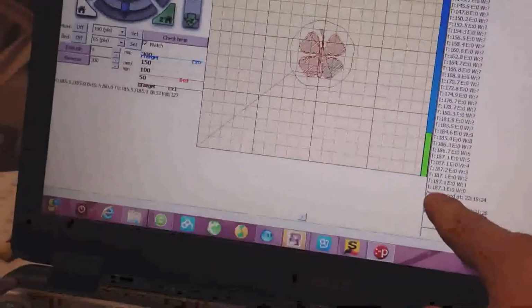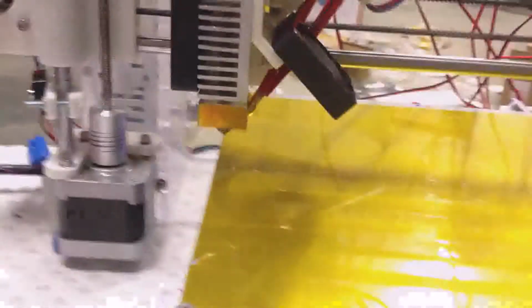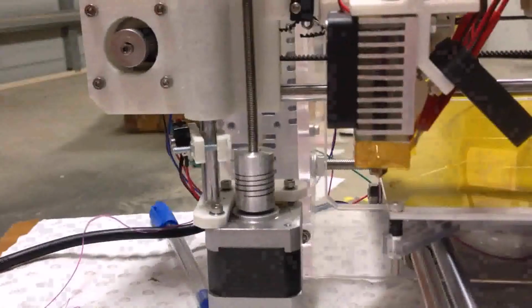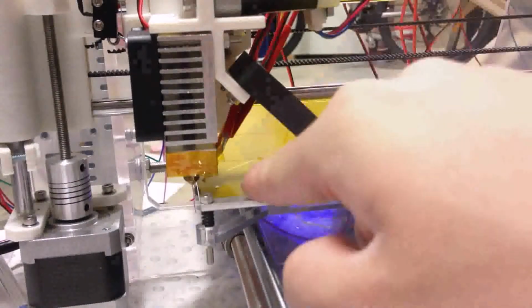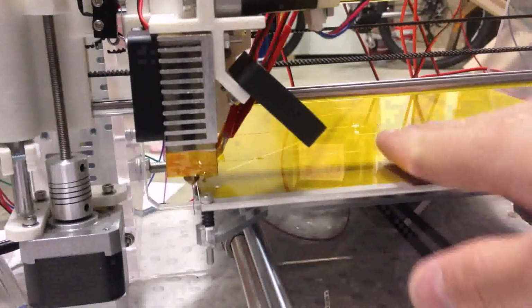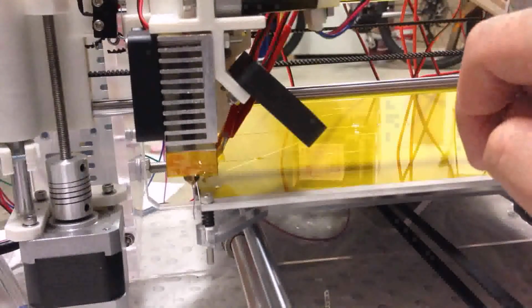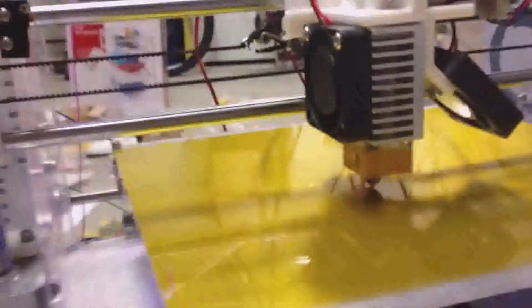So what you can do is just restart. But now if you want to restart, it's very easy because the temperature is already at its working temperature. So now what you should do is just restart. And once you press this, all these things go back to the original place. So what happened just now is that the temperature of the material suddenly changed very cold, and it left the hot bed. So what you should do is make it very hot, like this. So we will start again.